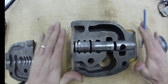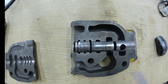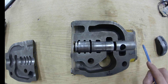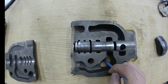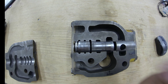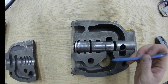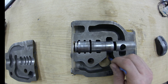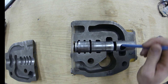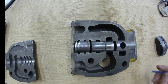With the valve closed, base end oil is allowed to build up pressure and actually lift the machine by pushing the cylinders down. So to summarize this quick drop valve: we are able to lift; we are able to drop quickly by having rod end oil open this valve using regeneration — that waste oil goes into the base end; and we are able to power down or lift the front of the dozer by building pressure in the base end, allowing that pressure to close this valve via the piston, and allowing rod end oil to simply go back to tank. Those are all the modes enabled in the quick drop valve.